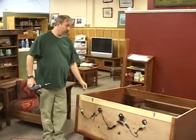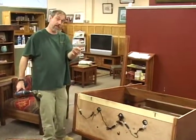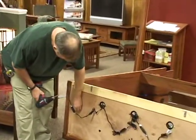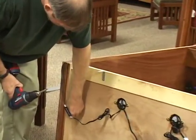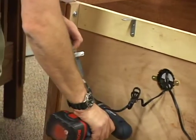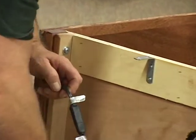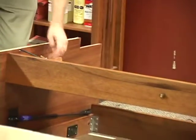This is how you fasten the roof to the sides — these machine screws right here. You'll see holes in the roof and a t-nut that's on the side. Just run these screws in and tighten it up. You have three here and three here. That's what holds the roof on. The headboard is mounted the exact same way — you have two on each side.